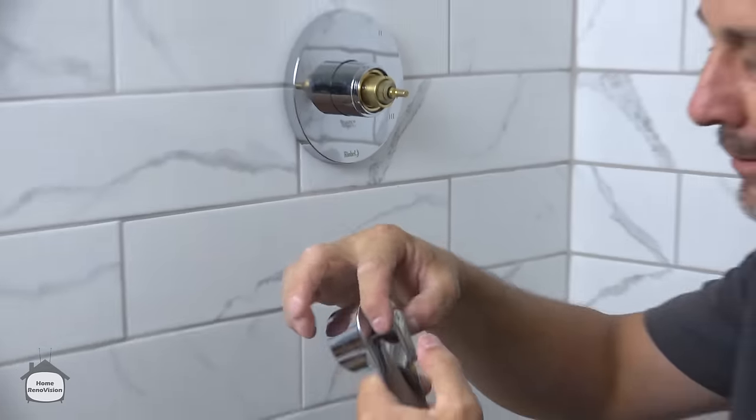very important that these caps, you'll see, they have a scooped out edge and then a flat ridge. The scooped out edge is top and bottom, and it goes where this rod comes through. So as long as you install it right, it'll fit nice and flush. If you don't, it'll leave a gap. It'll look ugly, and then water will be able to get inside that fixture. Okay, done.